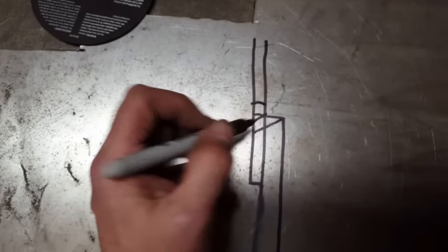Again, it fell in again. I tack welded it across there, a few tacks. I'll cut it and I'll tack it every so often. Now, right here, I ground at a 45, and right here, I went straight in at a 90, and you can see the difference. Look. So, going at a 45 closes up the little gap a bit.